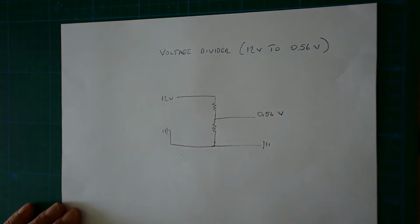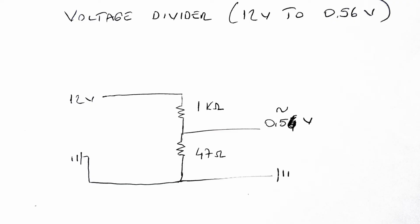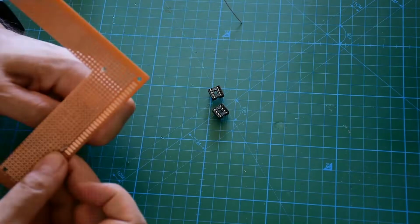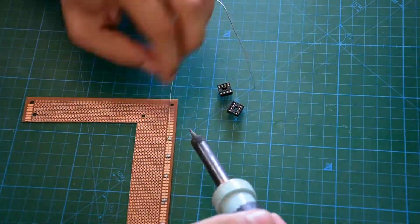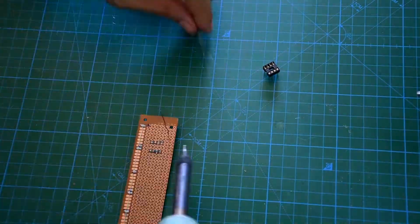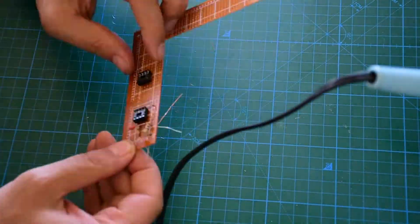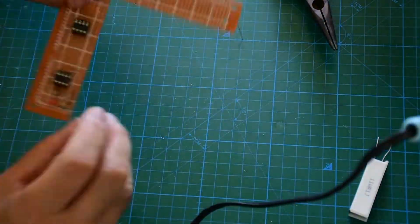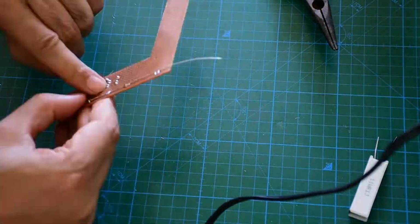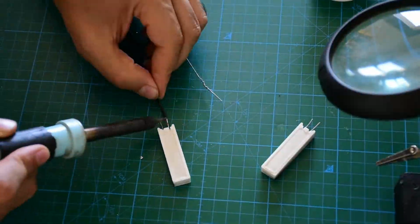This is the source for the op-amps. I need at least 0.5 volts to flow 5 amperes through each 0.1 ohm resistor and MOSFET, so I used a voltage divider. I tried and found 0.56 volts is much closer to draining 10 amperes from the device. There may be a voltage drop in some components, wires, or connections, or my resistors are not exactly 0.1 ohm.